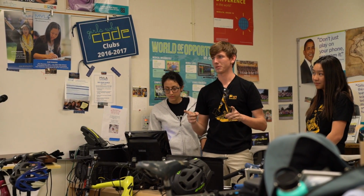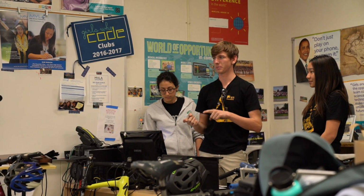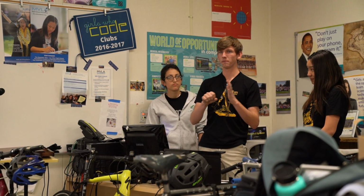The reason why we're doing suction cups, aside from being able to grab both a hatch panel and the ball, is that we want to be able to get the ball as fast as possible, run in, grab a ball, have control of the ball, and then leave. And suction cups are really good at this because they only need to control one face of an object. They don't need to go around an object to hold it.